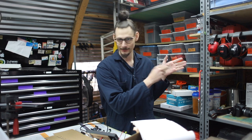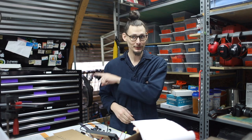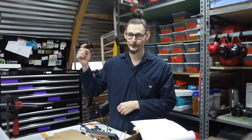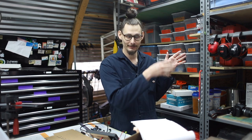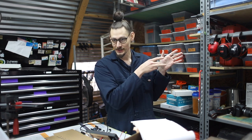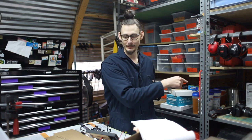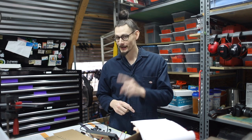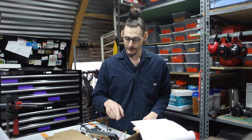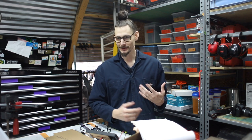One for the red values, one for the green values, one for the blue values. Then you have a switch that maps to a button array in a function that says, hey, I want button 1 to go to color red, which sets values in your virtual tables, which are LED 1, 2, and 3 RGB values, which then get post-processed on the steps to the CAN, which then gets encoded into hexadecimal, which then gets broadcasted over the wire, which makes the colors change. And you just put it together and it's fine.